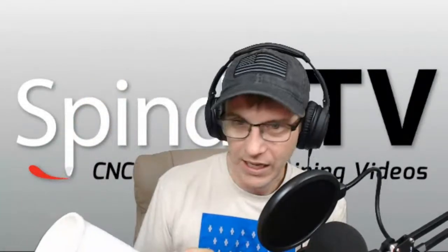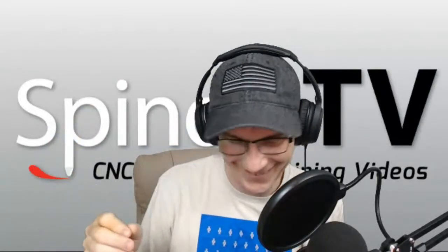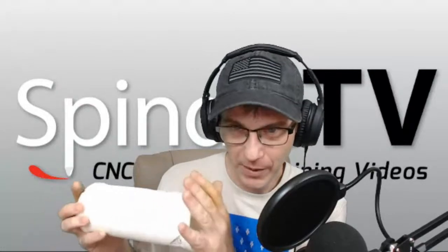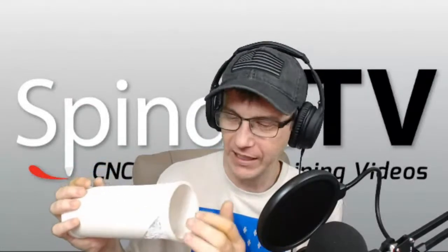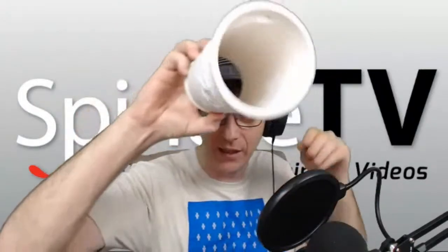Well, it's not done yet. As you can see, it's partway done, right? I misgauged when I made my wooden plugs to sit on my fourth axis. It's all about the setup, guys and girls. I was off on my center on my plugs. My plugs were perfectly fitting, but the center, when I put it between the centers, was off slightly, right?